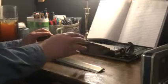Wood with twisted grain or wood that's so soft the blade just goes through it really, really deep and you end up with a blade penetrating up to around here and it wedges. Well, if you're taking 2-inch chunks out of a piece of wood, you're not that concerned about a bit of wedging anyway. But where this blade is so flat here and has no primary grind, it has no taper.